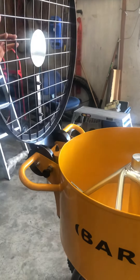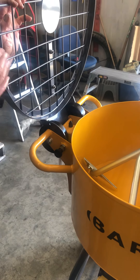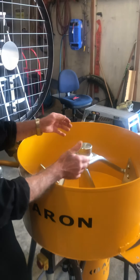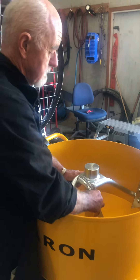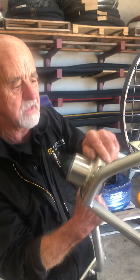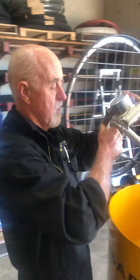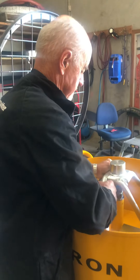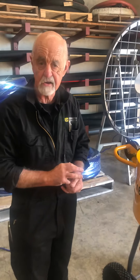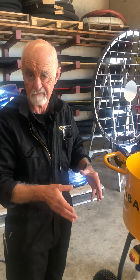There is a safety device — you cannot open the hopper until this is pulled out. Behind there is a safety switch so that the mixer will not work when the lid is lifted. Cleaning out when you're finished is very simple: once emptied, pull up and it's out. This particular model has a four-paddle mixer, where the other one is a three-paddle, so there's a variety available. We can also supply a rubber cleaning liner for some models, so you're working against rubber rather than steel, making cleaning even simpler.